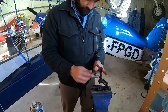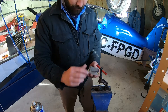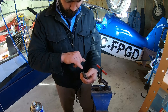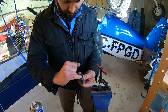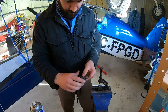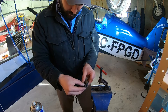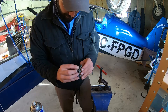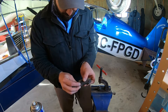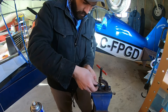Those are looking very nice. Now we need to place this part in our anvil and take our new pad — these are Rapco pads and they've got nice wear indicators on them so we can see how much life is left; once you get to the end they need to be replaced. We'll take our little rivets and pop them through the pad and then through the backing plate, doing that with both of them.